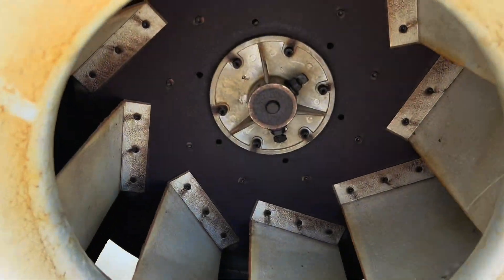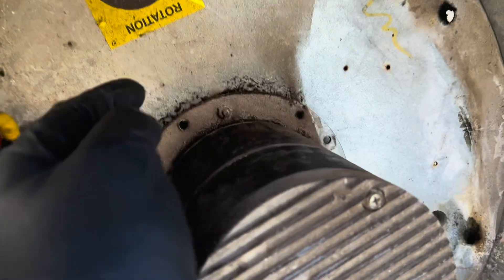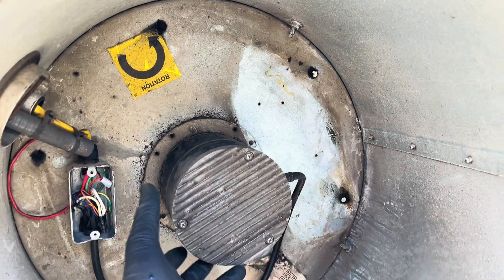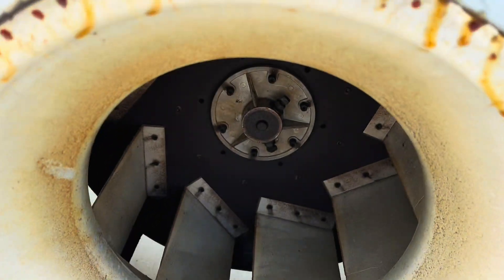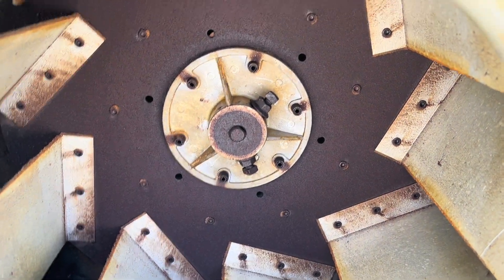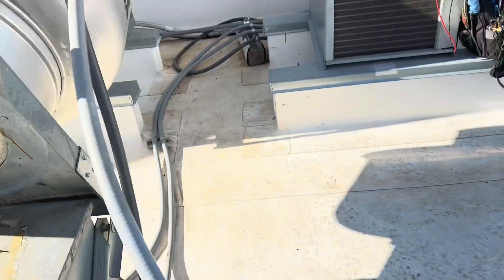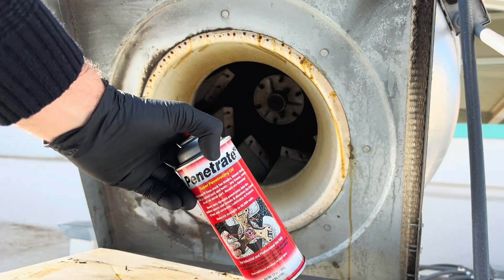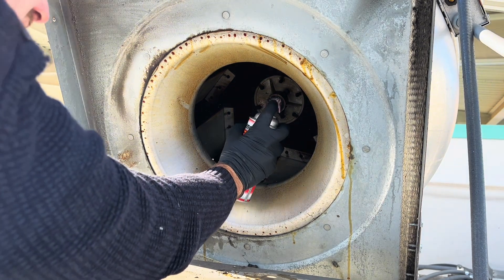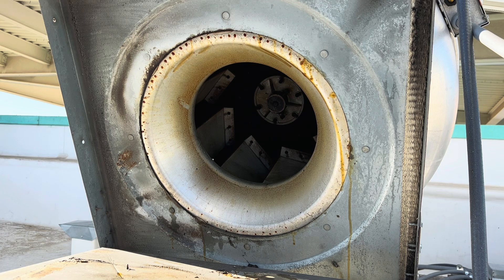You have a hub down there, you undo these set screws, undo these mounting screws, undo the electrical, then you can pull this out. I'm gonna get my rust penetrant — apparently if this gets stuck it's very hard to get out, so I'm gonna clean out the shaft and put some rust penetrant just in case. Usually on kitchen motors there's so much grease they're well lubricated, but you never know. Spray it on there, let it soak, and clean it up a little.